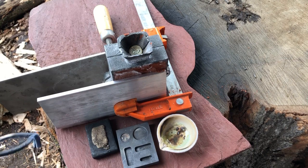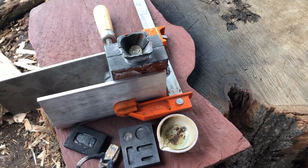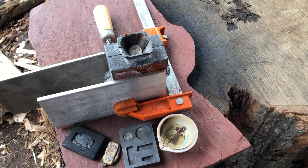Operationally not bad for a first try. There's our little brass ingot — overflowed it a little bit, but we'll polish that up. As far as the furnace system working, I am thrilled with how well this thing is working. The mold is questionable — we'll see how the coin turns out. The crucible was so small and I didn't have a tool handy to get the dross out, which is the impurities that float to the surface. Usually you spoon those off before you pour — writing down our mistakes for next time.